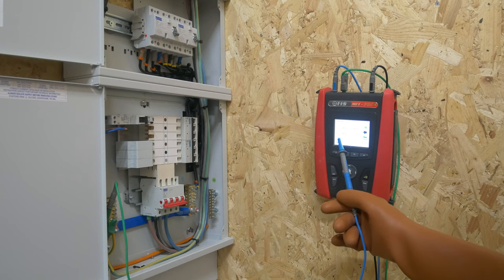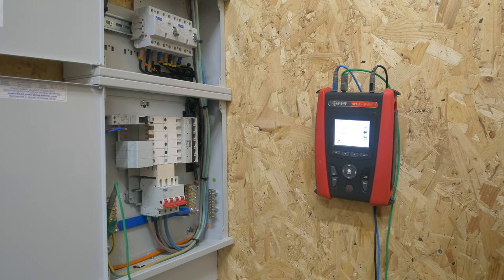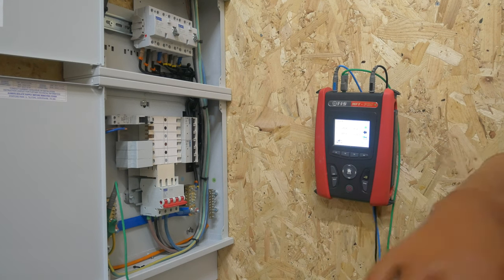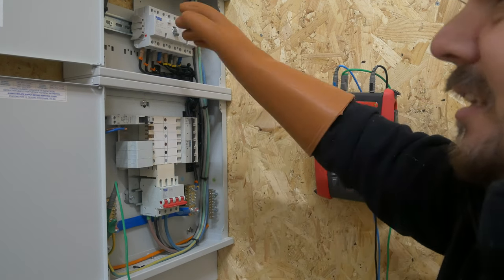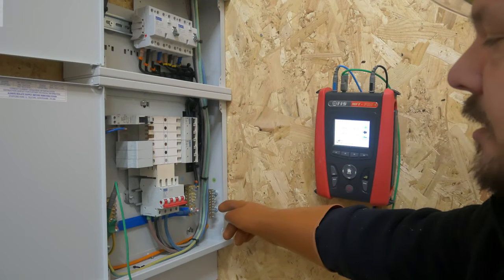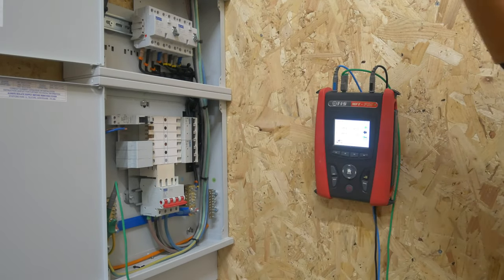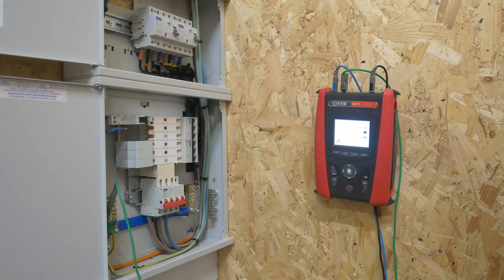It's a little bit lower on the PFC, so you're a little bit higher with the measurement, and that's most likely just due to the length of the cabling within the distribution boards. At the origin, the earth is ever so slightly longer than the final conductors — basically the board's the same at the other end, so they would come in and terminate in this RCD. But the earth's running down into this bar here, and we've also got the earth cabling within the isolator at the other end too, where it runs through and it's a little bit longer. So it all just adds to the impedance ever so slightly — that's why you see that tiny difference.